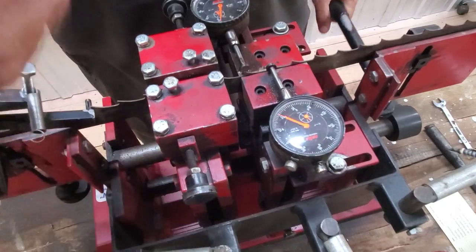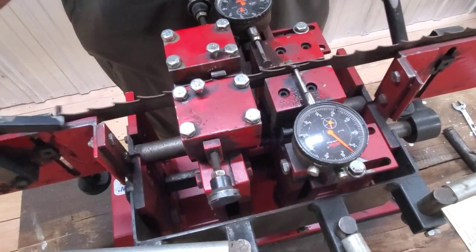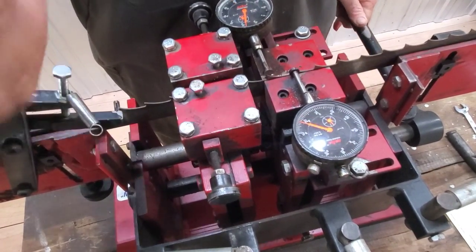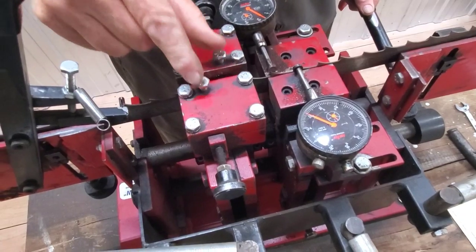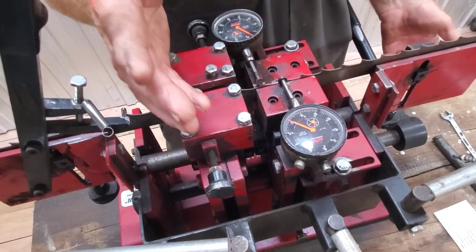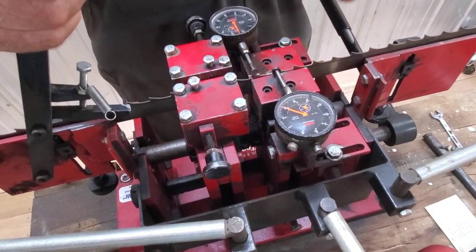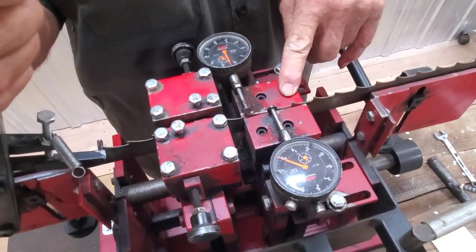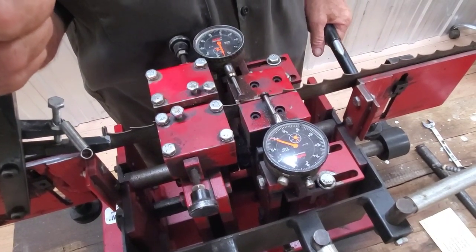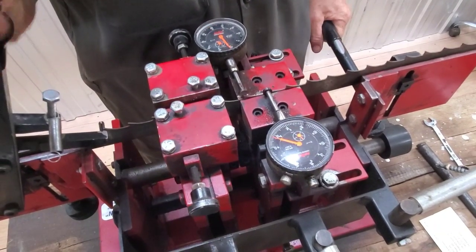Right at 20 and 21 — that's one. One, two — okay, they're all hitting pretty good. That's why he doesn't tighten these down: if he comes over two thousandths he can adjust it back. Cook says if you're within four thousandths that's good enough, just rock and roll, because this thing is made for speed not accuracy. But he likes his customers and likes doing this work — if he sends out bad blades, he won't have customers. So he tries to stay within two to three thousandths.